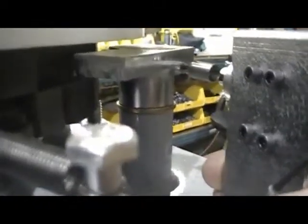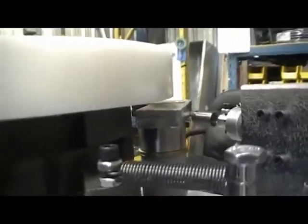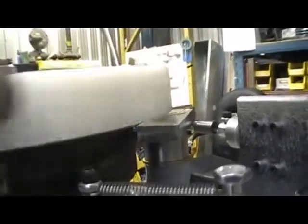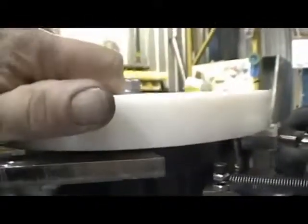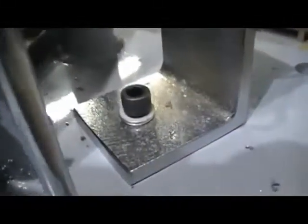So what you want to do is set up this pawl with just enough pull so it clears. See how that pawl is just clearing? See how it's just clearing like that? Right? That way when you've got the proper action on the solenoid, it'll do its locking bit. See what I mean? When it's free, it spins. When it locks and engages, it goes right in. Okay? So now we found that little honey spot where that seam is. Now we can tighten that bolt down all the way.